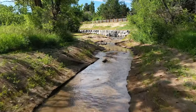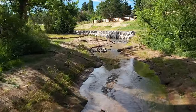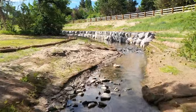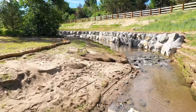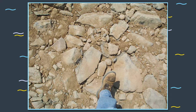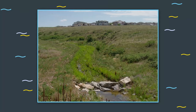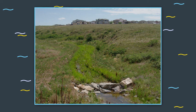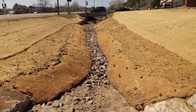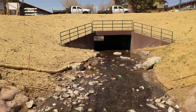VFR does not rely on roots for stability like soil riprap does. In applications where it is difficult to establish vegetation, VFR is better able to resist direct, prolonged impingement of water than soil riprap. Because of all the additional materials that need to be added and mixed together, VFR is more challenging to install than soil riprap. VFR is commonly used for grade control structures such as riffles, bioengineering applications for stream bank and bed protection, rock-lined swales and rundowns, and erosion protection at culvert outlets.